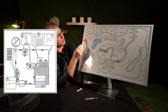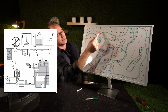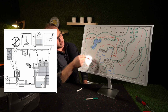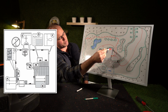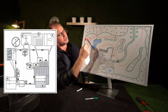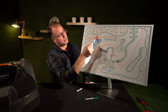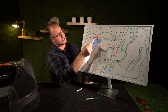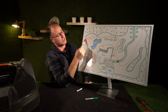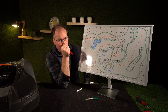So as long as that tail finishes on an anti-clockwise position from any of the islands, so the current is coming around the boundary this way, right around back to the charge plate, that guide wire can pass over as many islands as it wants along the way, as long as the last island you go over, and where this tail is, the tail is in an anti-clockwise position from any of those islands. So there's really no limitation to that.